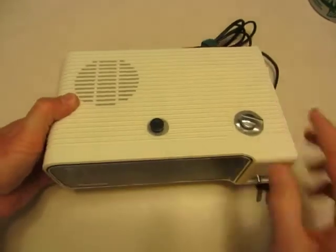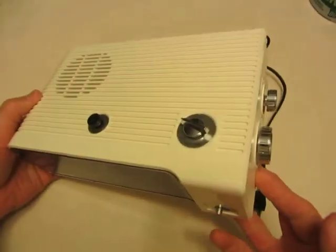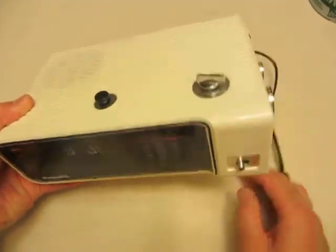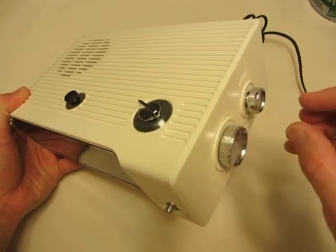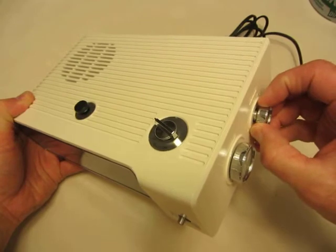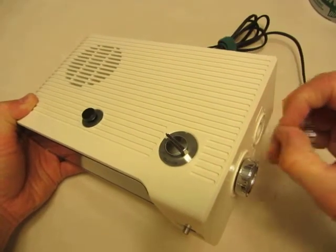But the stopping point people are having is these knobs. Every one of the knobs have to come off for this to be accomplished — every one of them except the switch, which does not have to come off. To make this happen you have to pull straight out. What people are having problems with is these old clocks haven't been taken apart in a while and they're afraid to pull.